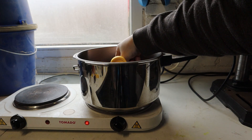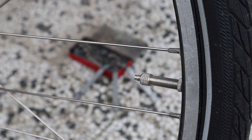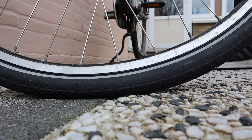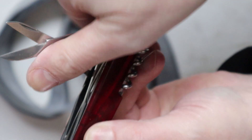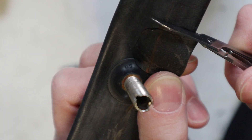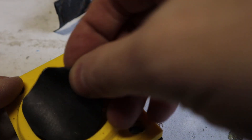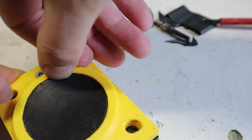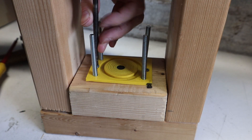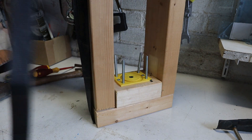Printing the sound box is easy, but it's the membrane that's difficult and the stylus that's hard. What we need is something that can transfer a great amount of force to convince a thin piece of aluminum to take the shape of a 3D printed mold. Normally a thick piece of rubber would do the trick, but since we don't have that, a few sheets of rubber from an old tire will work just as well.